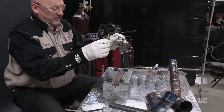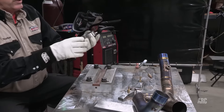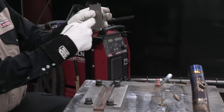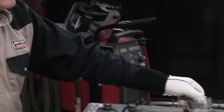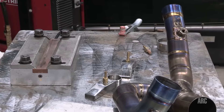They have different types of trailing cups. You would also have your backing gas, which goes on the back side. Say I was welding on one side of this plate, I would also want to protect the back side of the plate as well. Any part of the titanium that's exposed to oxygen or nitrogen in the air could become hardened and brittle. It's also very important that we keep it shielded during welding.